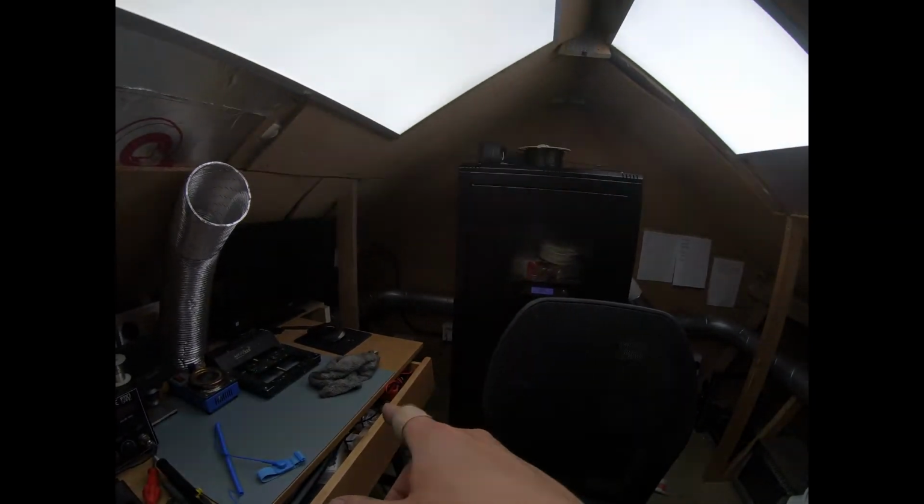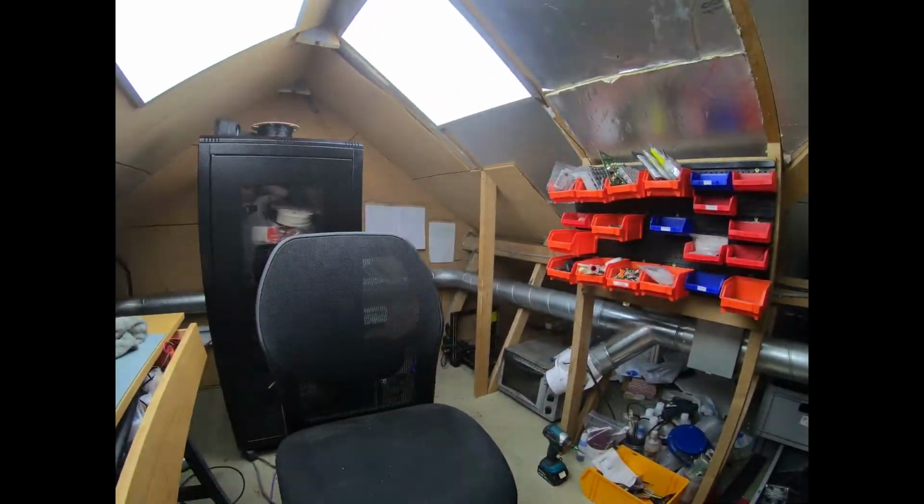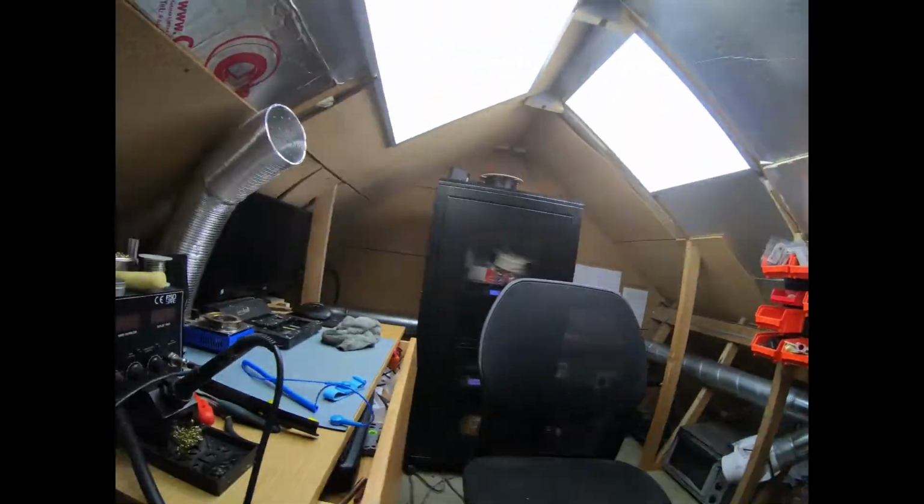I've just realised the mistake. I've just looked at that and realised I need to get one of these in. I didn't go and cut this duct anyway. This duct was just an off cut, and I just thought I'd stick it up there just to measure at least that distance. But obviously, this T piece needs to go in. Because we're going to have two cabinets in here, you won't really get into that space too much. So we're probably going to have the oven here. So I think this particular piece is going to need to go probably there, and then we can have just a tiny bit of flexi duct coming off of that. So yeah, we'll get that in as well.